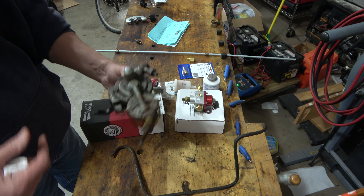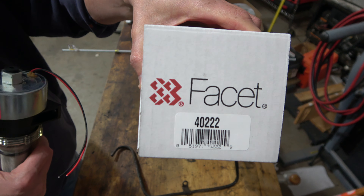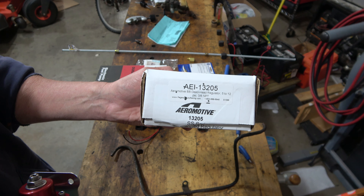What I'm replacing is this whole assembly. I may need to get a shutoff valve to turn off the fluid, then a filter to catch moisture and water, and then the pump — the output is here. My intent is to install in series a fuel filter, which I've marked to be in line prior to the Facet fuel pump. The filter I chose is a Kubota fuel filter since I have a Kubota lawnmower.